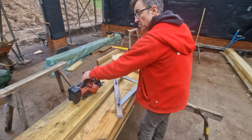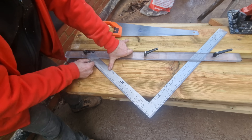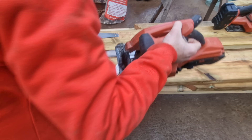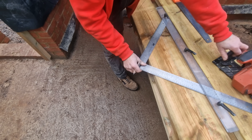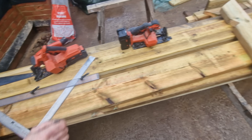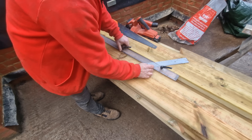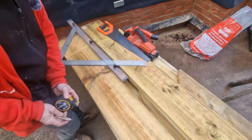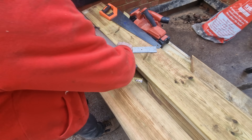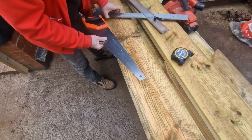I'm going to mark a foot, starting with the seat cut on the bottom of the timber. That's the foot cut. I'm going to come up 200 to here — that is the seat cut of the bird's mouth, that's where we're going to be sitting over the wall plate. Now that measurement I took — the 153 — is what I want to measure down to find the point of the bird's mouth. So I'll do a faint mark here and a faint mark here, measure down 153. Join those lines up, and where they cross the seat cut is my bird's mouth.